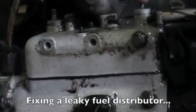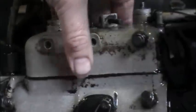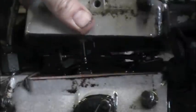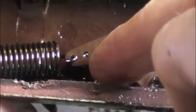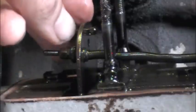So far I've removed the throttle control and the cutoff switch and these two nuts. Now you're supposed to see where that spring attaches. Can you see it? It's got to go right back to where it is now. The inside of the housing, that spring goes in that last hole, and then the other end of the spring goes in this top hole through this little pin with that little spring. That seems simple enough.